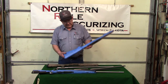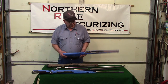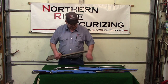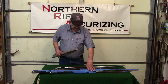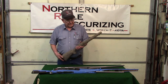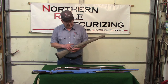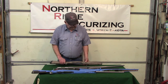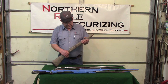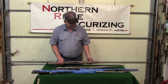Bedding is very important. Most all stocks have to be bedded, whether it's a wood stock or a synthetic stock. A lot of the synthetics nowadays are more or less a throw-away stock, so we stock a lot of different stocks on hand. The synthetics that we use have an aluminum bedding block for rigidity, and these also need to be bedded so that you get all the accuracy out of them that you can get.